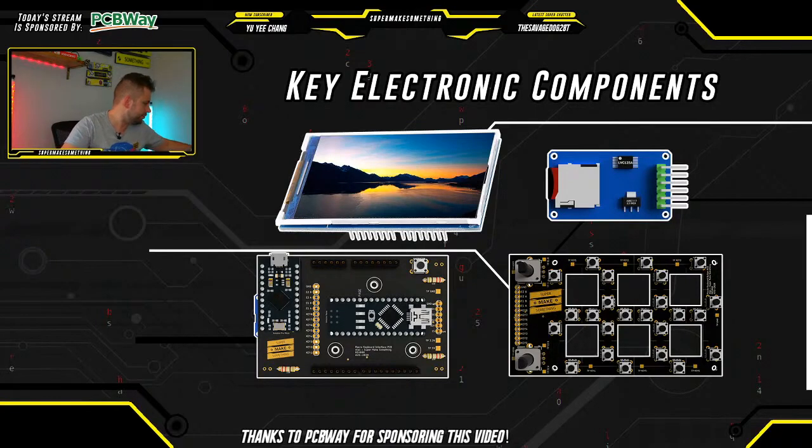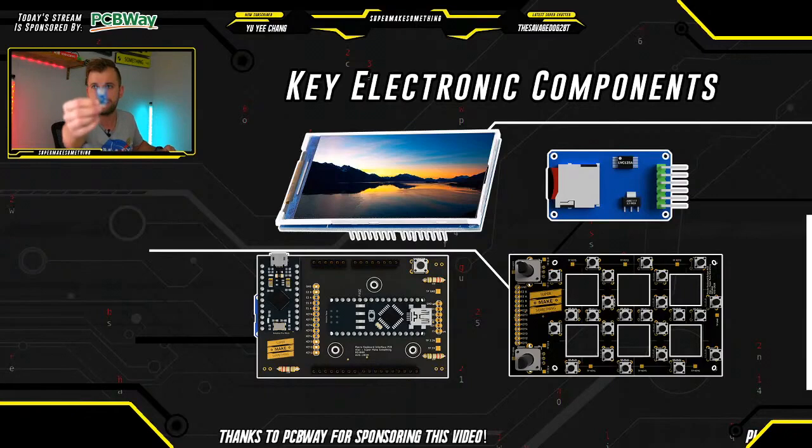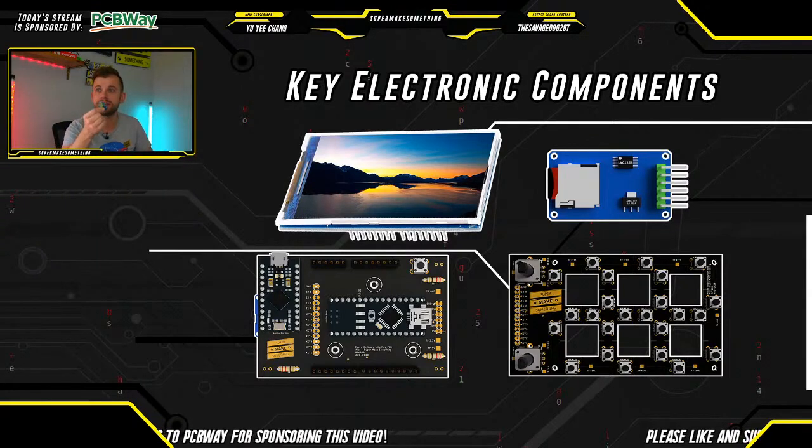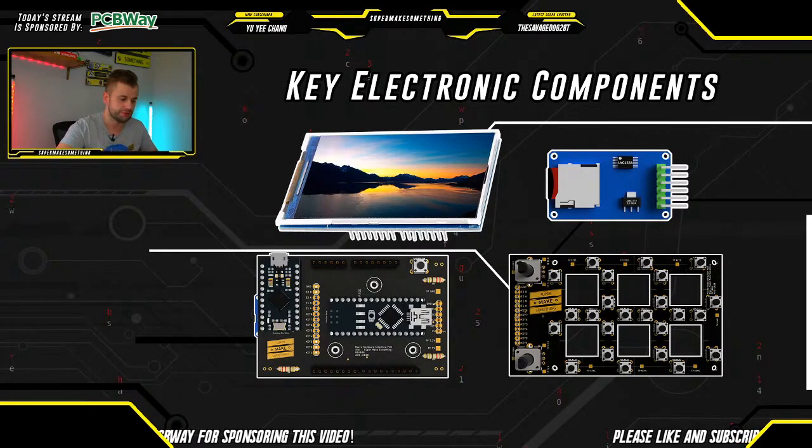The next thing that we use is an SD card reader. This also connects to one of the Arduinos. This SD card reader stores all of the graphics that you might want to assign to each of the buttons, because neither the Arduino nor the LCD screen have enough memory to actually store any graphics. This also makes it easy to update graphics, because instead of having to reprogram the Arduino every time you want to update a graphic, you can simply replace the files on the SD card and reassign icons as needed that you make in Photoshop or some other graphics editing program. So that's a nice handy thing.